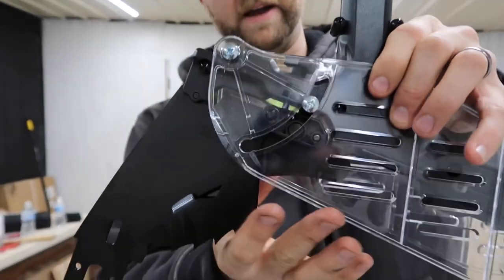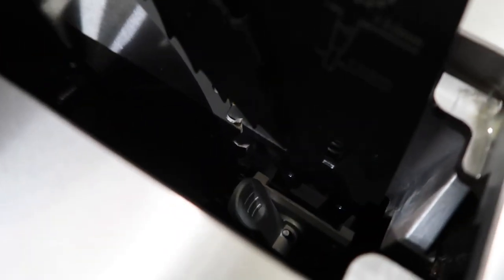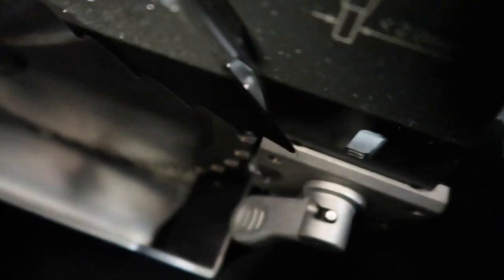So we've taken out our riving knife. Let's go ahead and insert our riving knife anti-kickback with the dust collection system. We go down in here, gently, push down until it locks in place, and go ahead and push this locking into place. Just double check it — make sure it's in there. It's good, it's locked.